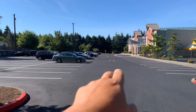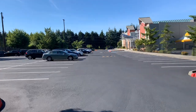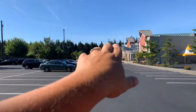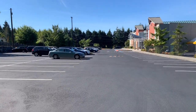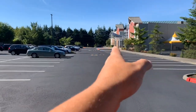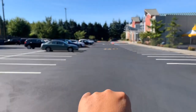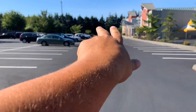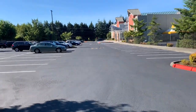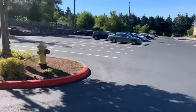You got 3 sets of speed bumps here. Okay. And what we want to do is we want to try to put the new speed bumps where the old plastic speed bumps are. Same concept here. Find the center. 6 inches to the right, 6 inches to the left. Do an 8-foot speed bump, 8-foot speed bump. So you've got 2, 4, 6. Okay, so you got 6 more 8-foot speed bumps going down this drive aisle.